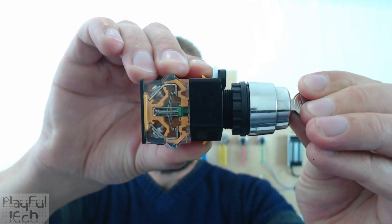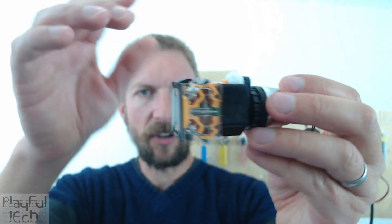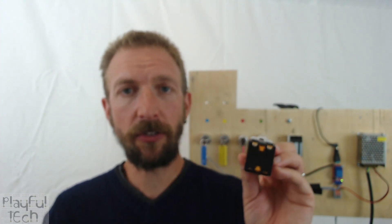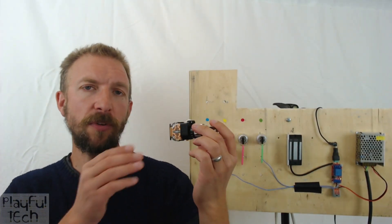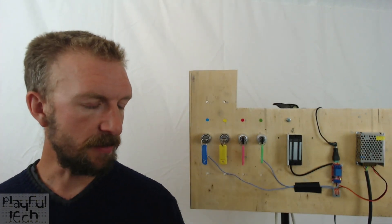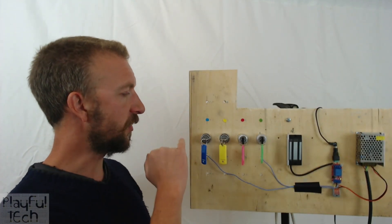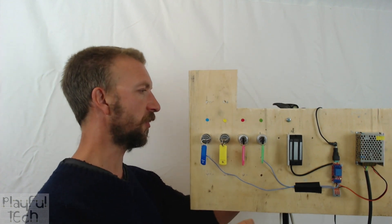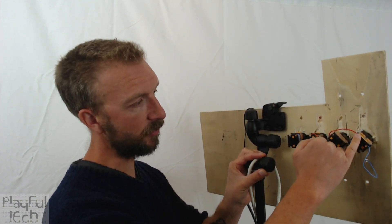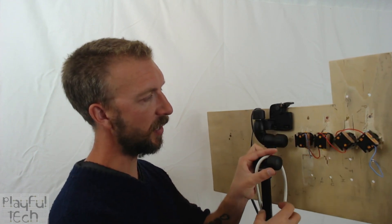When I twist the key on the green side, they actually become connected. So simultaneously we've got a pair of contacts that are normally closed and become open, and on the other side a pair that are normally open and become closed. For this particular circuit, I'm using the normally open (green) terminals. If I twist this around, on the reverse side you can see it's simply a wire coming out from each one in turn — just a series connection — and these blue wires take it back around to the front.